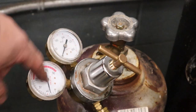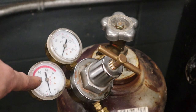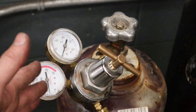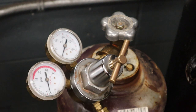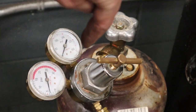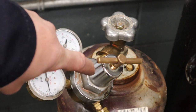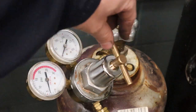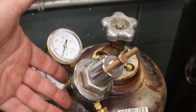The regulator pressure handles are the only thing that is kind of backwards from everything else. If I want to increase the pressure and allow more to flow, I go clockwise. If I want to back off on the pressure or fully stop flow, I go counterclockwise. Here's a trick to remember: this is a screw that as you tighten it goes down like a normal screw — you'll feel it getting tighter because you're squishing down a spring, forcing a sealed valve to open up and allow gas to go through. When you back it off it gets looser as the spring extends and seals.